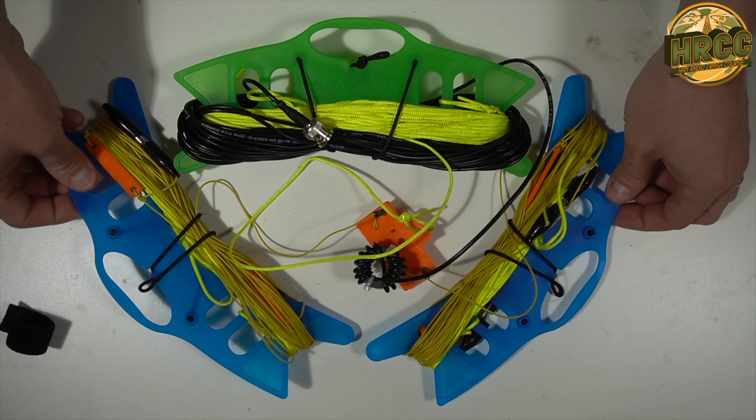So what do I not like about it? There's not a lot. I hate to say it, but I've got nothing bad to say about this product. I kind of like it when I can just review something that is really, really good. There's not a lot not to like about this. It'll handle about 100 watts single sideband — at least that's what it says on the Band Hopper 3 page. I don't know if the same is true for Band Hopper 2. I assume they're the same material, so it's probably 100 watts single sideband and less for CW — call it 50 watts or less. I'll send them a message and find out and post it in the description.